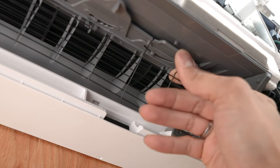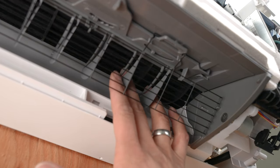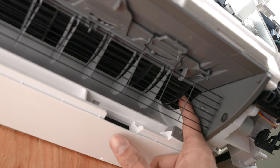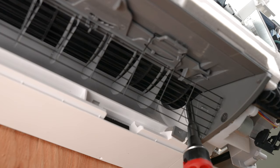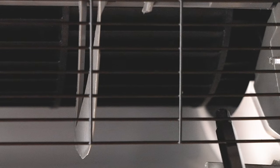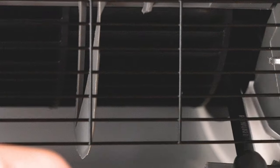Give us a little bit of room to move. Now, the reason we're doing that is because we need to get to the set screw, which is back up under here. Then we're going to rotate our fan wheel until we find a missing tooth in the blades all the way to the right, which happens to be right here. I'm going to take our screwdriver and line it up in there. Once you get lined up on the set screw, you're just going to loosen it up a little bit — usually one to one and a half turns will do it. You can tell it's loose because the wheel will shift.